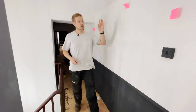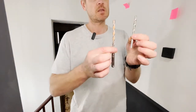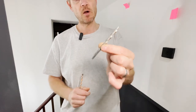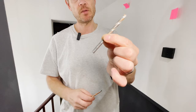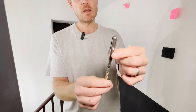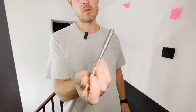We've got our holes marked, now it's time to drill them. We'll need an 8mm hole, so here are two 8mm drill bits. This one has a parallel shank and it's for use in a standard combi drill — it will have a hammer function but it's a standard combi drill and they don't necessarily hit that hard. This one has an SDS fitting and is designed for an SDS hammer drill — they hit much harder, and this is what we'll be using.